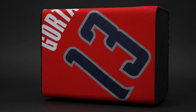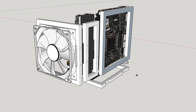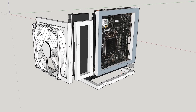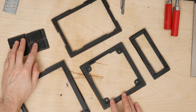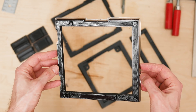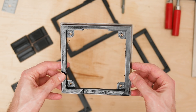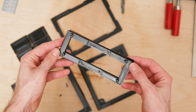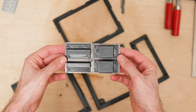Before I go on I'd like to thank my Patreons — I really appreciate your support. Let's start from the frame, which I designed with tenth of a millimeter precision. Its key feature is modularity. Each piece has a set of anchoring points allowing for a variety of arrangements. This way I can use the same components in future prototypes with different layouts. Frame elements are connected using joints and M3 bolts.